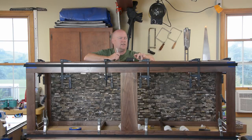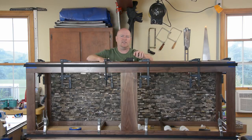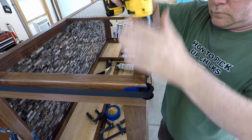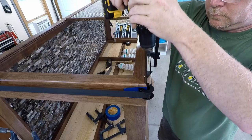The back is going to get screwed on so that I can put the whole thing in place and attach the back later, rather than having to move it around with the big heavy back already on. The back will also give you access to replace the big piece of glass that goes at the bottom. In order to clear the sliding track grooves, the screws have to go pretty close to the outside edge of the frame, so pre-drilling is an absolute must.